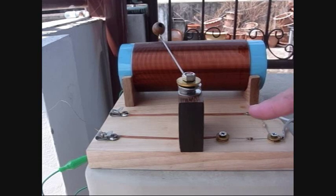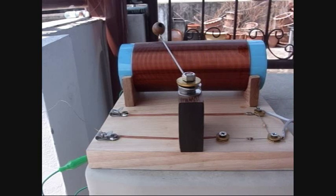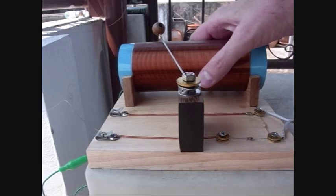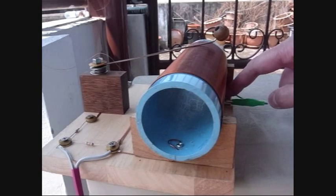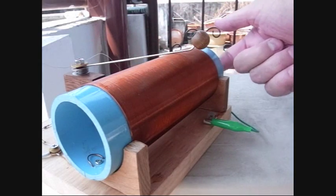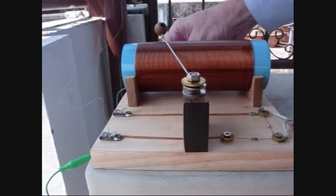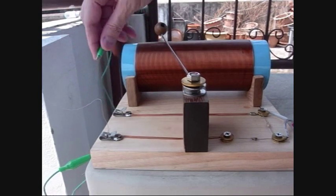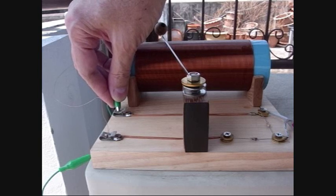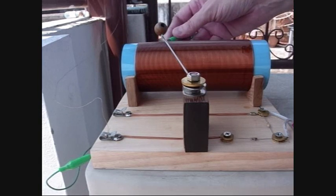This is a direct test of the Boy Scout radio, the modified Boy Scout radio, and this version. I've installed a cheat — a second connector in the back that connects to the end of the coil, so it's exactly like the modified Boy Scout radio. I can compare the two directly by just moving the ground or antenna from this point to that point. In this version — the new version — connecting it back here makes it work exactly like the modified Boy Scout radio. So let's try both ways.